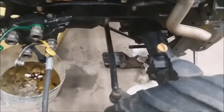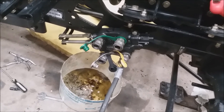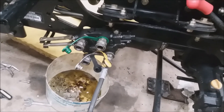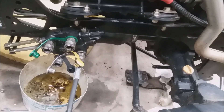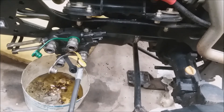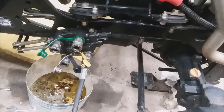The reason I'm going through all this and jacking up the pressure is I want a little more lifting for my loader. I just happened to have a hydraulic problem — one of the lines is leaking — so I had it in my shop and went ahead and increased the pressure. I went from around a thousand up to about twelve hundred PSI. In my opinion I wouldn't want to go much higher than that, though it could go up to thirteen or fourteen hundred. The maximum is fifteen hundred PSI for the hydro.